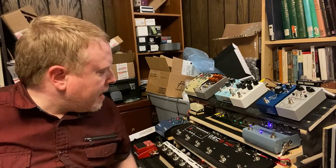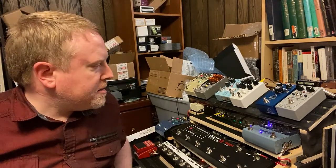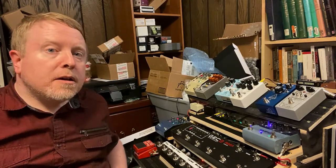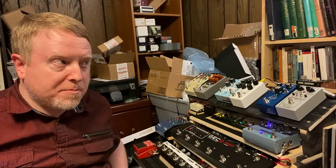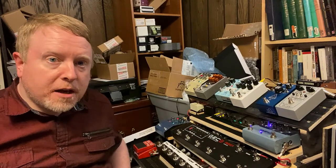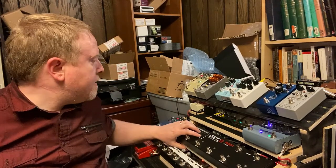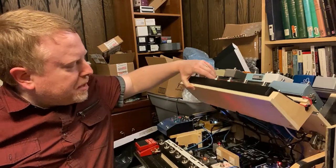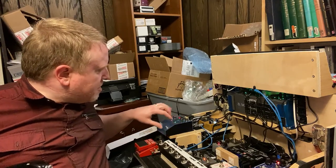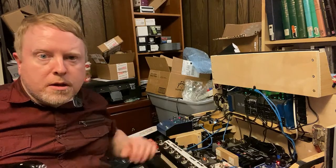So I'm going to test a couple things here. I think the first thing I'm going to try is to split the signal chain — basically cut it in half — and see what difference that makes. And then I have another really high quality buffer that I can try to add after I get a sense of what might be the best place to put it. Then we can test and see what things sound like after adding that. I want to split the signal chain and see what kind of difference that might make just in terms of signal loss. I could do it out of the MD-200, but that's already got a buffer on it. So maybe I'll just come out of the loop switcher here and see what that sounds like.